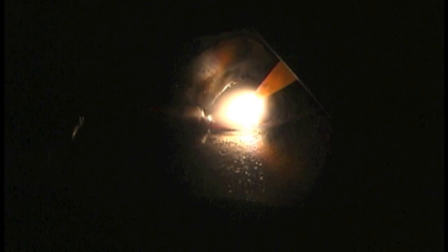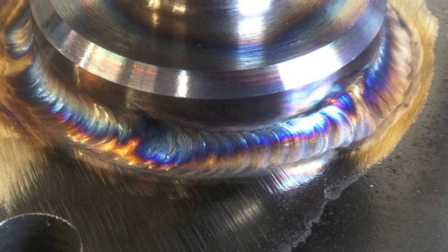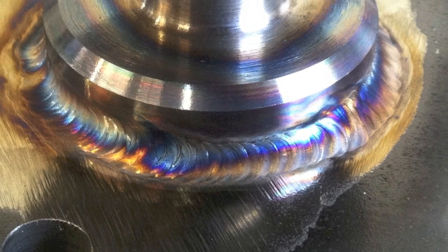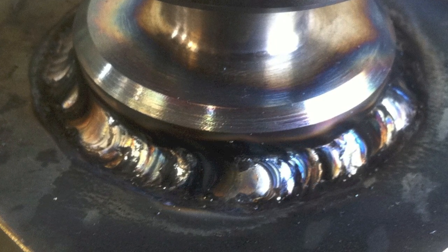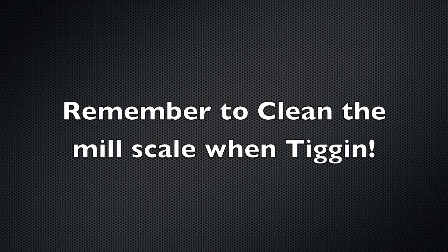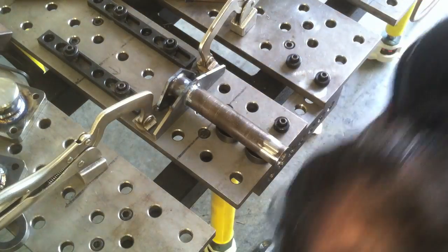This is all just 1010 to 1018 steel — a hot roll piece and a real clean piece. I cleaned it pretty well, but hot roll is tough to get off sometimes. It depends on what steel mill it came from — some is really hard to grind off, some is a lot easier. It sure does weld better when you get it off. I forgot to clean one of them and you can see it there — it just takes all the fun out of TIG welding if you don't clean the hot rolled scale. See: the ones that were clean flowed really nicely, and the one I forgot to clean didn't. I just drove on anyway — probably shouldn't have. Remember to clean that mill scale when TIG welding on hot rolled steel.